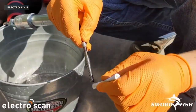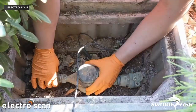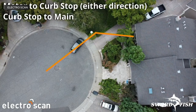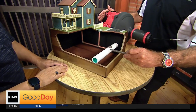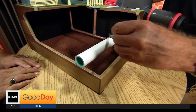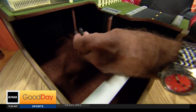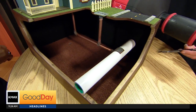So you see that going up through the house. This is really key because all of the cities, all the water companies will tell you — if you ask them do you have lead — they'll say no. So if we take a look at the model that I brought: here we have a white pipe, this is the water main. What the water utilities have actually inventoried is this little pipe here, so they'll say there's no lead. The problem is from the meter into the house — that may have lead.